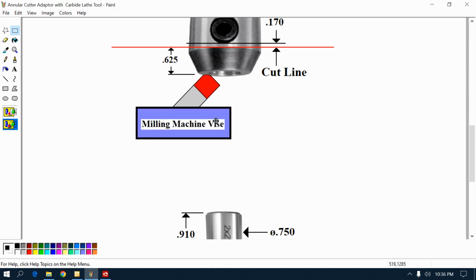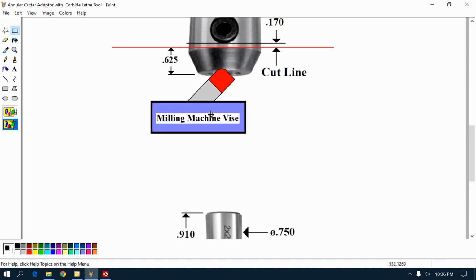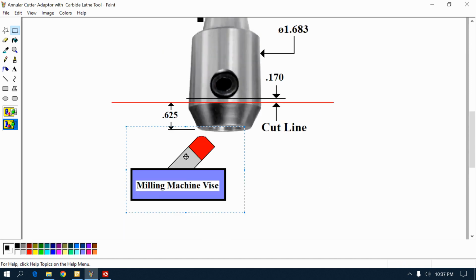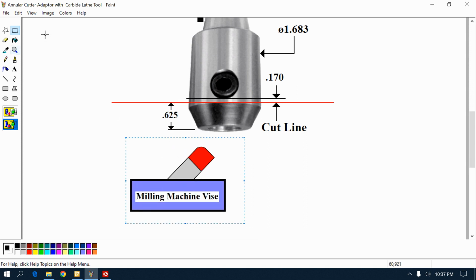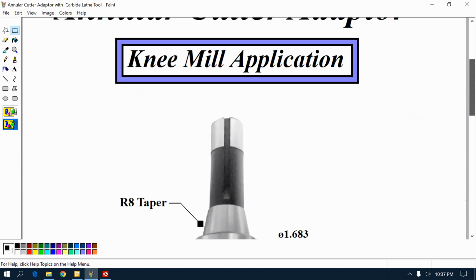I'm going to come up here, touch off with the carbide, set my dial indicator on 0, and start making 30 or 40 thousandths passes all the way in till I reach this cut line. You see it right there? Alright? And now when I'm done, it's going to raise a burr, obviously. I want to come in here with this cutter, put a chamfer in there on the ID, knock the burr down, come up here where the red line is on the diameter, and put a little chamfer there to soften the OD. Alright? So that's the basic plan. I'm going to get out in the shop very shortly and demonstrate what I just showed you. Alright, hang loose.